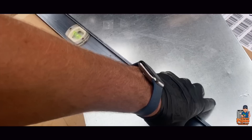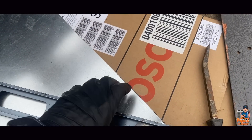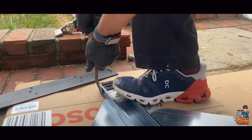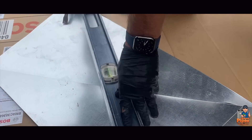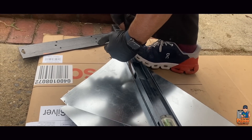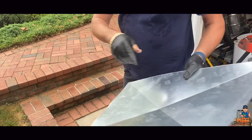We have a little flange here and a little flange there, so I cut out the bottoms where the flange is going to meet. We put our level right there on the mark, about an inch from the corner, and score with the big flat screwdriver — just like that. We do the same thing on the side. Just like they did at the factory. Now we'll get our flange tool.